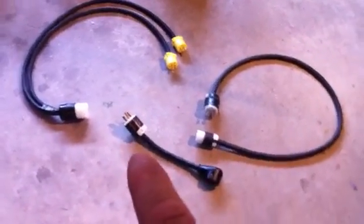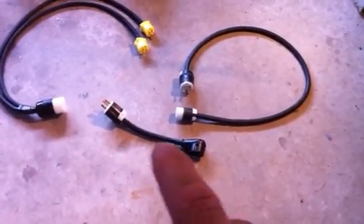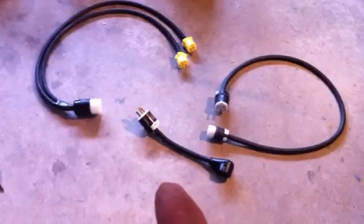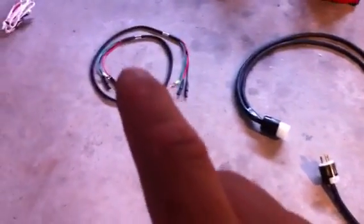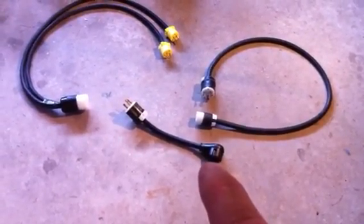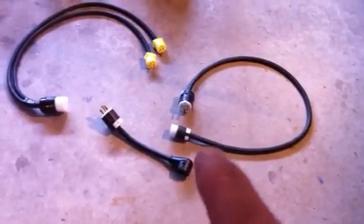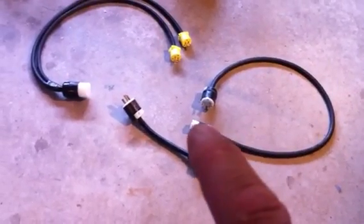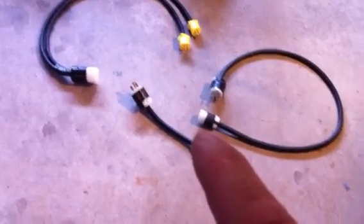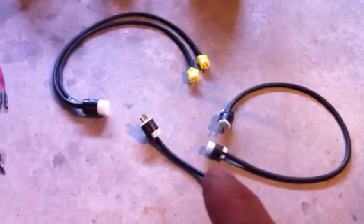That plug-in is a 30 amp twist lock, and what I did is made myself a 30 amp 120V twist lock to an RV plug — you can actually buy these factory made at most places. Even the EU 2000 companion kit has that cable. I also have a 30 amp twist lock that goes to a regular 15 amp plug-in. I use that because then I can plug into my house or any appliance that runs 15 amp but needs a higher surge to start.